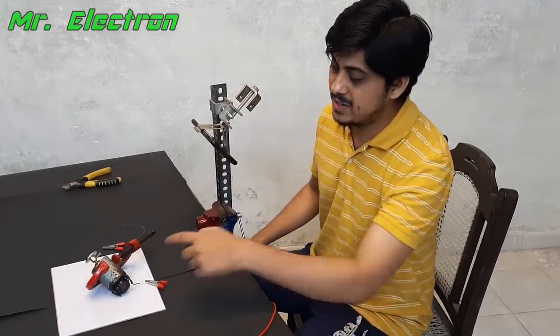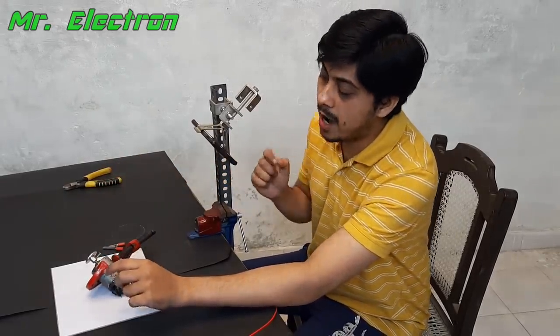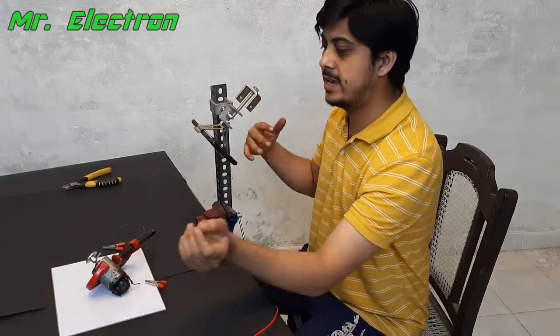There are a few things we learned from this experiment. This motor that I used is a 220 volts DC motor, and I converted it into a high current DC motor — coming from 220 volts down to as low as 12 volts. I used fewer turns, because of which the resistance reduced and the current automatically increased. I also used three times thicker wire, so again the resistance reduced. It needed more and more high current, and obviously the brushes were not designed to handle that high current. So the result was that the motor burned out.